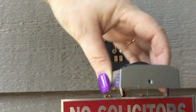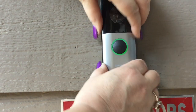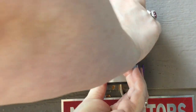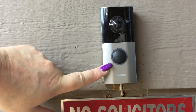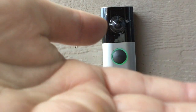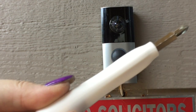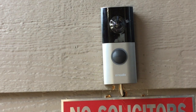I'm also going to strongly suggest that you lay a towel or something down because you are working with some very tiny little screws and they happen to bounce when they hit concrete. So if you drop one, good luck finding it again. We're now going to go ahead and attach the doorbell. You'll notice that there's a hole in the bottom, which happens to be flashing green — that's the light you can see around the actual ring of the doorbell. You simply need to slide the doorbell onto the mounting bracket and push it down. Then they include a very small screw that's going to go into that hole in the bottom — you want to be careful not to drop that. You'll take the flat edge of the screwdriver and use that to go ahead and screw that tiny little screw into the very bottom.